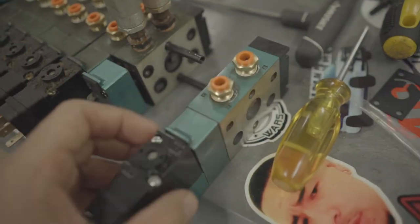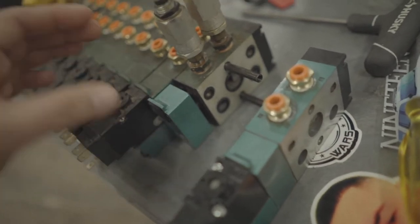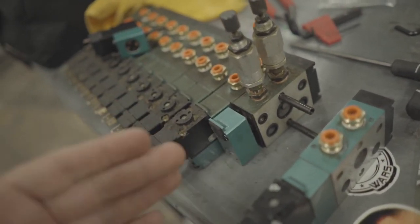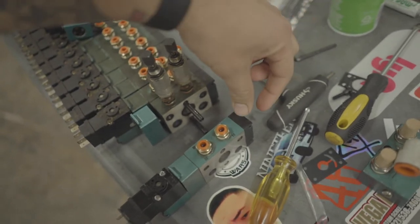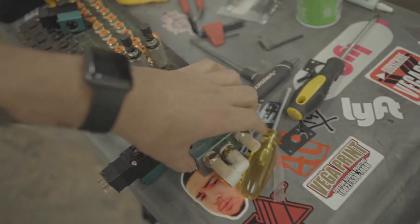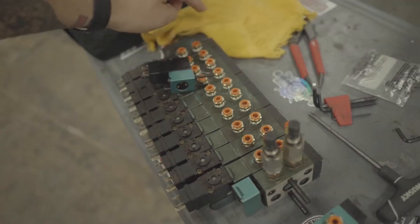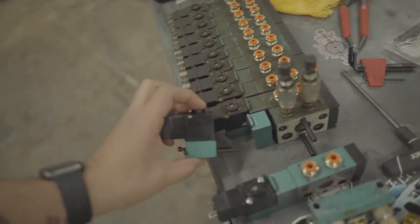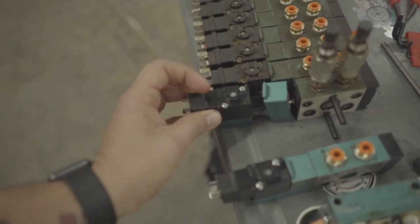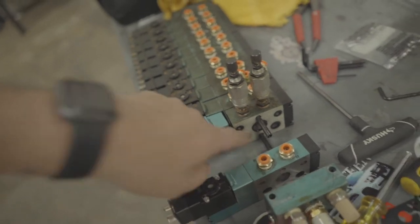What I'm going to do today is take them out one at a time, clean them one at a time, and put them back together. I'm going to grab some tape and number them, going from the back end: one, two, three, all the way to 14. This is the only component that was brand new because the guys that installed my press replaced just this one, but we still have to clean everything inside.